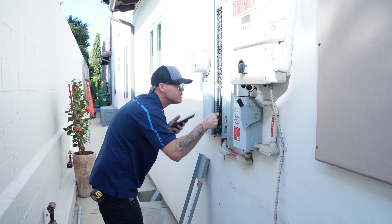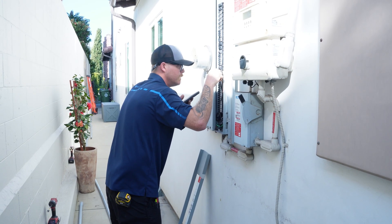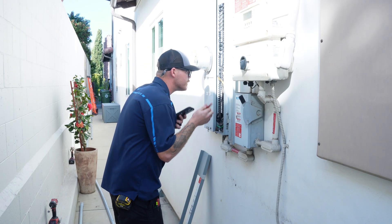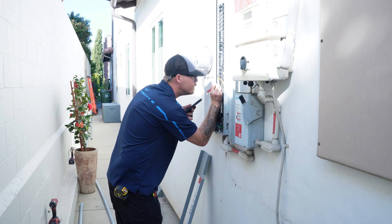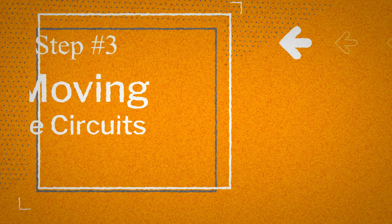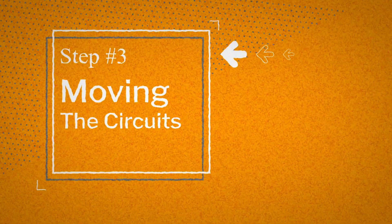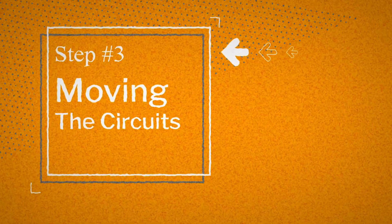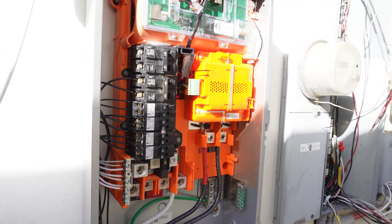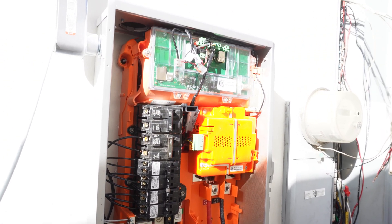So that's going to be a 12/2 circuit — that's good. And then next in the kitchen, you also wanted the dishwasher, so it's probably dishwasher and disposal. We have eight spaces left, but that's dependent on if he does any more two-pole and three-wire circuits. So just keep rolling through and I'll let you know what else we've got.